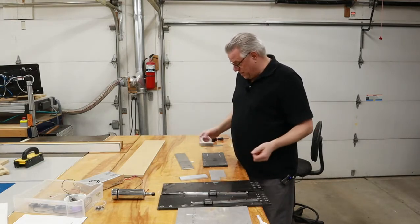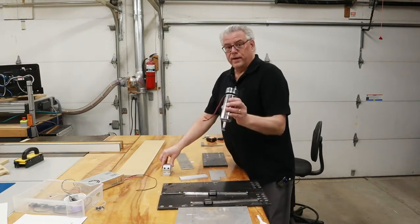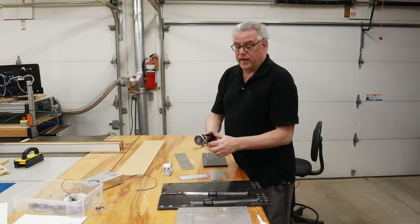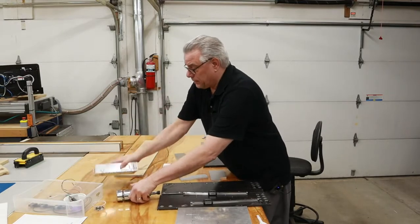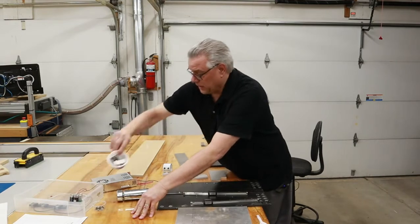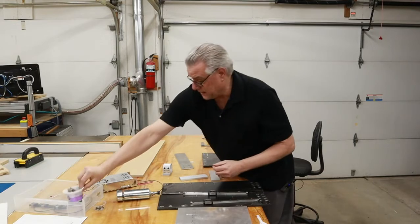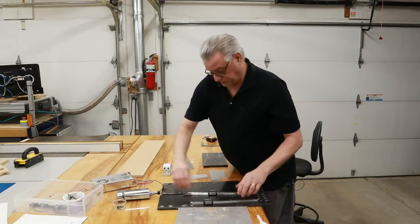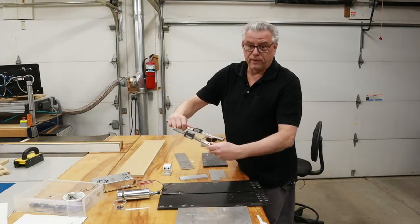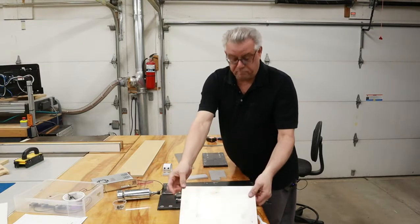So what I got here, just to give you a quick rundown, here's a 500 watt variable speed spindle. It's got a collet, I believe it's ER11 size. Power supply, spindle drive, some miscellaneous fittings, not even sure what they're for. Nuts and bolts, couple of linear rails from another project, not even sure what they were from. Big chunk of aluminum,